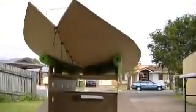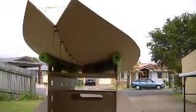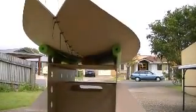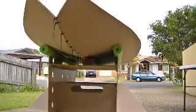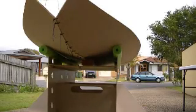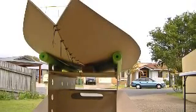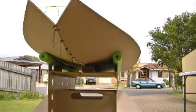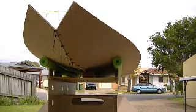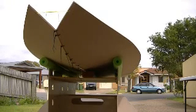To make life a little easier I've put an upper support that can be removed in the boat stand supplied with the plans. At this stage I haven't had to use the framing moulds or the jig. You can see here it is just the two bottom halves stitched together using MDF material — it's not meant to be a boat, this is a mould for the new 11-foot shark dinghy. This was quite an easy thing; I just added that extra floor above what had been in the plans.